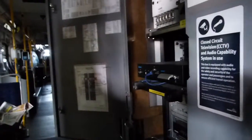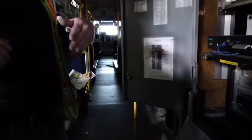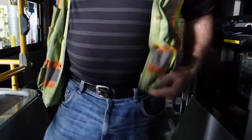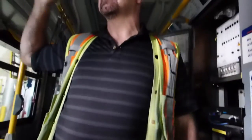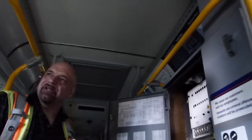You can see the number of kilometers too. It also has the number of timeouts — like an EPU cycle count, remember we talked about it earlier? It gives me a count of how many times this thing timed out. There is a direct correlation between a weak battery and number of timeouts. Lots of timeouts means your battery is sick. Interestingly, there's no correlation between the number of timeouts and heat. I have seen low timeouts yet heat problems, and I have seen weak battery capacity with no heat problems.